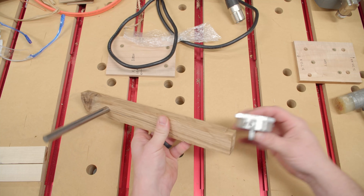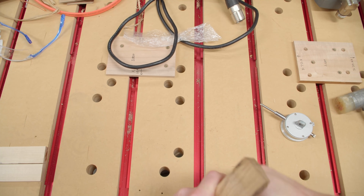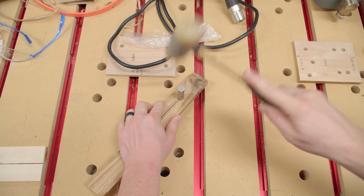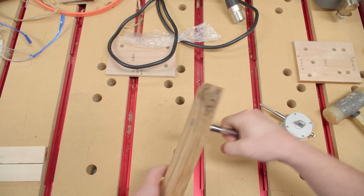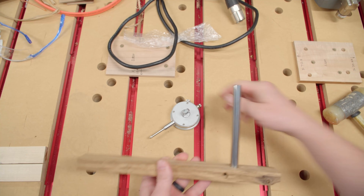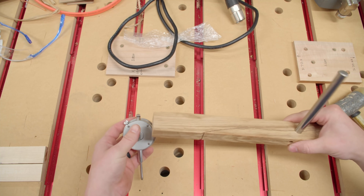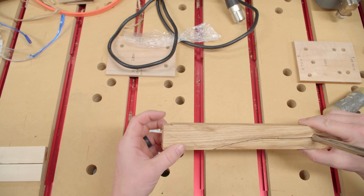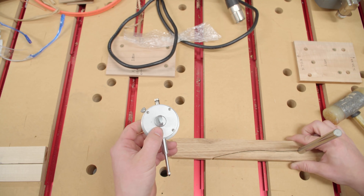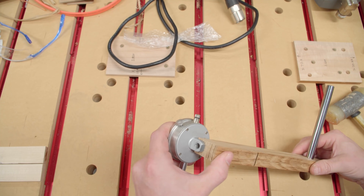I had the notch on the wrong side, so I drove the rod all the way through. I still can't spin it with my hand, so I'm not worrying about that extra screw. With this in the spindle, the dial indicator can be secured over here pointing down. The reason I'm limited to one direction is that I put a little relief cut here — because as this is secured, this higher spot would get in the way if I just screwed it in place. Let me secure that.